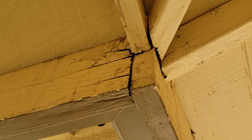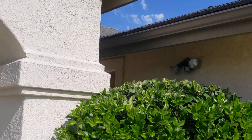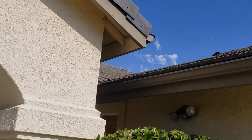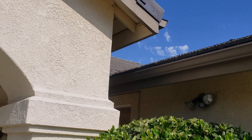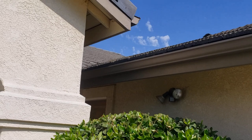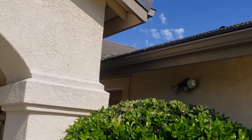Let me walk out here and we'll take a look at what I'm talking about. This roof valley right here — yeah, there's a roof valley coming down through there, and that's typical. What typically happens there is everybody wants their tile tied together in the valley so they're not looking at the sheet metal, the valley metal. What happens is the tighter you get that tile, the easier it is to dam water up. Once the water gets dammed up in the valley, it starts traveling sideways, gets off the metal, gets off the valley metal, and winds up burning holes in the paper — quarter-sized holes in the paper. I've seen it a dozen times before and I'm sure that's what's going on here.